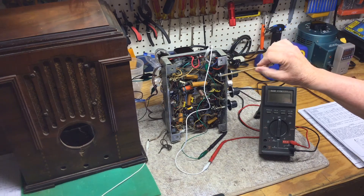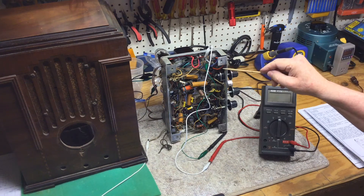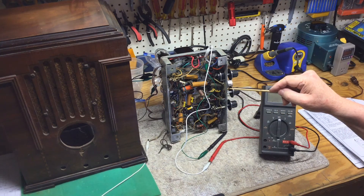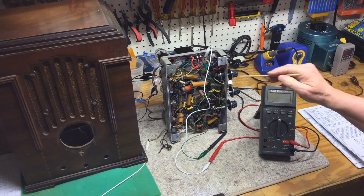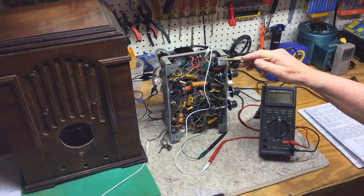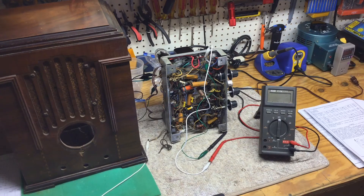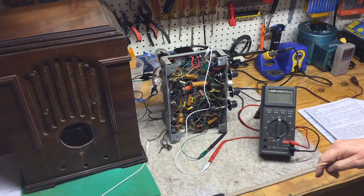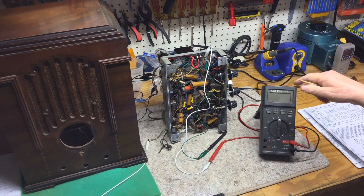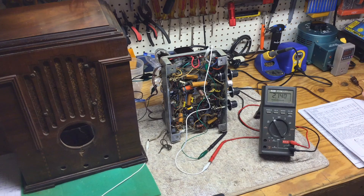I'll show some close-up videos on how I went about that in a later video. So what I'm going to do is bring this radio up, power it up, and we'll do this together and see what happens — hopefully we won't have smoke or fire. I've got a tie-in point here — this is the positive side of the electrolytic 10 microfarad capacitor right off the output side of the Type 80 rectifier. According to the schematic, I should have somewhere around 300 volts, plus or minus probably 20%. I've got the tie-in points here and I'll flip the meter over to the DC side.